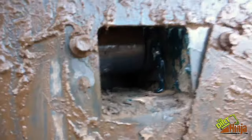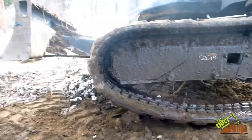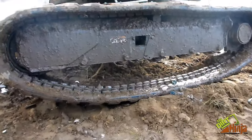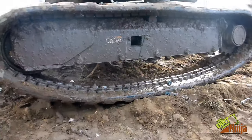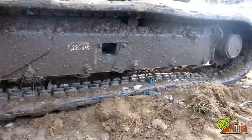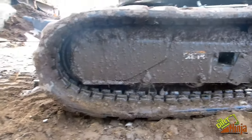I've gotten that tightened back up. Now what I'm going to do is let the machine down a little. See how much slack there is on the track — you want to let it down, otherwise you're going to be trying to lift the track all the way up, but you don't want to put it down all the way either, so there's not a ton of tension on it. The machine is still off the ground but there's a lot of slack still in the track.